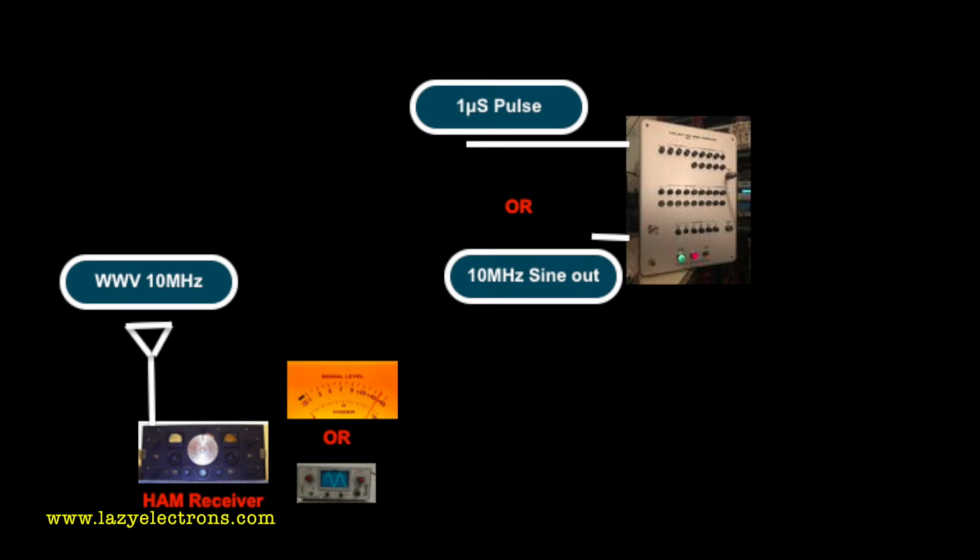Okay, welcome to the calibration procedure for Tektronix 180A. The crystal oscillator is calibrated by zero beating it with WWV. The service manual specifies the instructions pretty clearly. I thought I'd cover a couple of extra options which you could use today to do the same